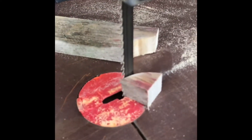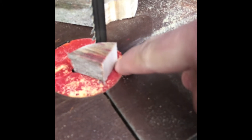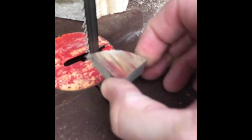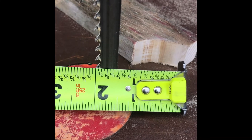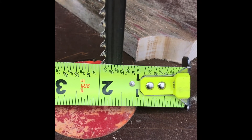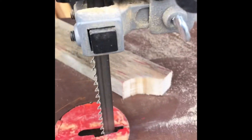What happened there was the height difference between the plastic and the steel caused the piece to get hung up, and I had to push it and scrub it through. So it will cut. Now let's talk about this blade — the carbide-tooth blade. From tooth to the backside of the blade it looks to be about a half an inch.